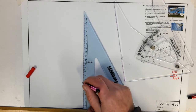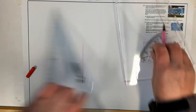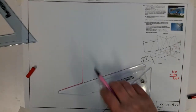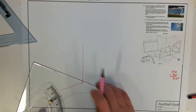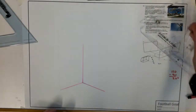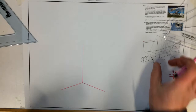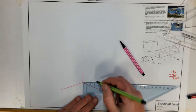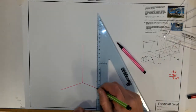Drawing up the Y-line first, then the X-line going the other way. Because dimetric projection means both angles are the same, the adjustable set square stays at the same angle. Since the base is seven meters, that means going 35 to the left and 35 to the right — measuring out 35, which is half of 70.